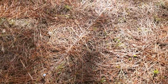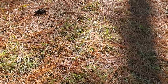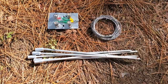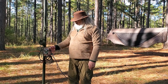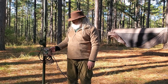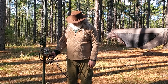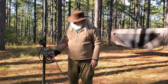The rods are placed every six feet, and together they're equivalent to a single 10-foot ground rod. We use the shorter ones because they're easier to pack, deploy, and remove — it's really hard to drive or pull a 10-foot ground rod. The wires here are coiled not just to save space, but also to act as chokes — a noise filter. It's always good to wrap a few extra feet of cable into a choke-balun effect.